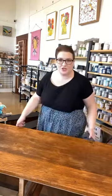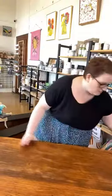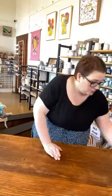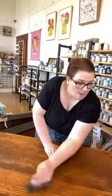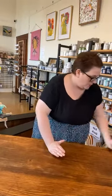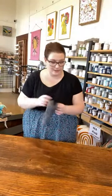All right, once you finish your sanding, a couple of minutes, doesn't take long. You're gonna come in with your microfiber cloth or whatever cloth you're using again, and you're gonna run it up and down. You can go in any direction you like, and you're going to wipe off all that excess oil. And then tomorrow, you'll come back and you'll do this again. So you'll just sand it down again.